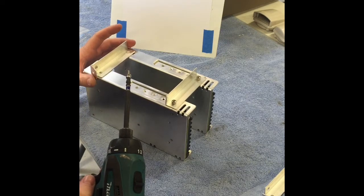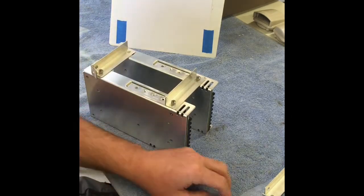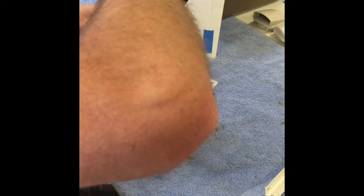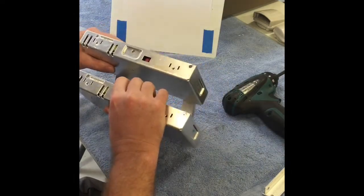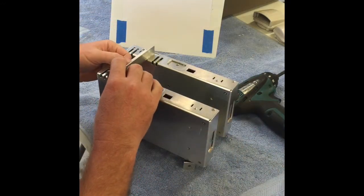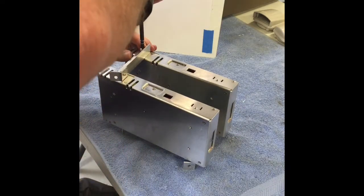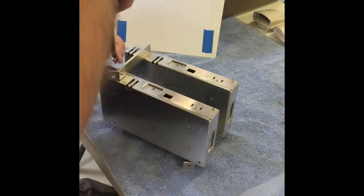Another reason I used aluminium is because I had it lying around — some off-cuts from something else — and it's relatively cheap. You can pick it up from Bunnings or anywhere like that; nothing special. You can mount it, offset it however you want. Once I get the other side in I'll nip the screws up. I'm on a real low torque setting — number one on the drill driver — so I don't strip the threads out.